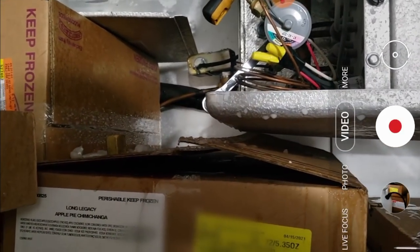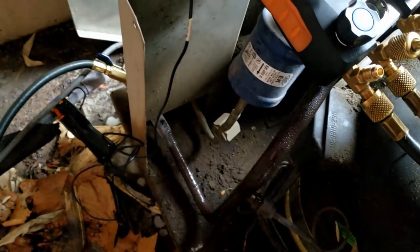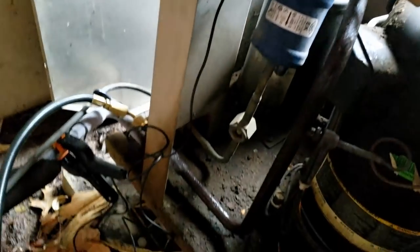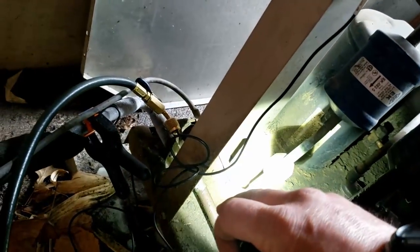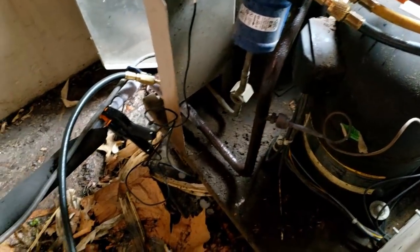I think we're gonna go ahead and leave it alone. So we're running at 31 degree superheat. We're not frosting up like we were earlier. In theory, I mean, it was starting it. Check our sight glass, make sure we're still full. We are. So sometimes that'll change on you after you get the charge set. Now it's letting more through the coil.